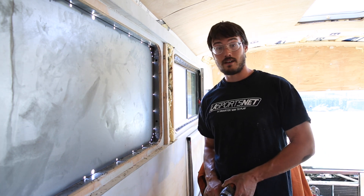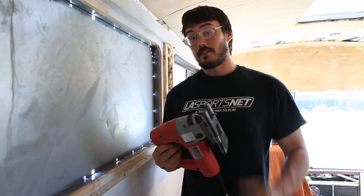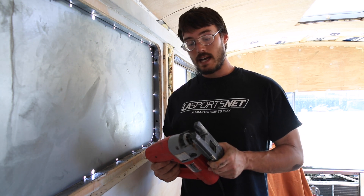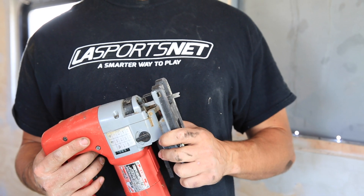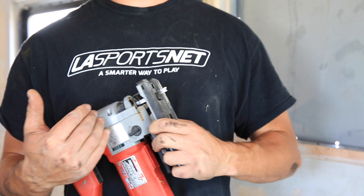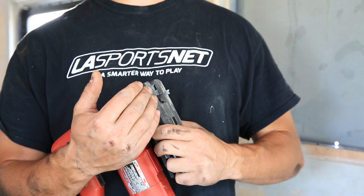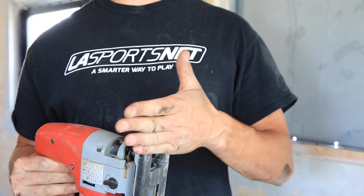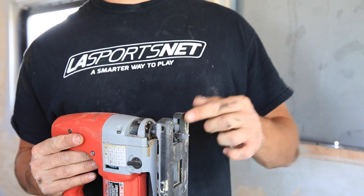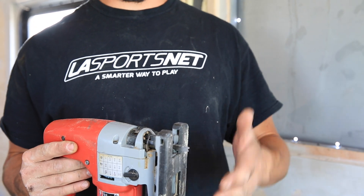Let's go outside and start cutting. We're going to be using our jigsaw with the metal blade. One thing I will say is that the first blades we were using I bought online because it was a good deal, and I didn't realize how short they were. The previous blades were so short that at their lowest position in the stroke of the jigsaw, the tip was extremely close to the plane of the jigsaw base plate. As you're running the jigsaw along — don't worry, this is not plugged in — it's oscillating in and out, and that blade was almost coming out of the cut just in its standard cycle.